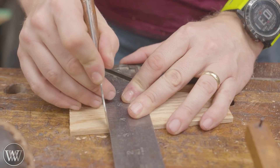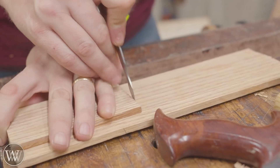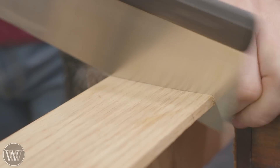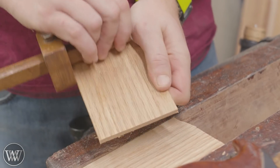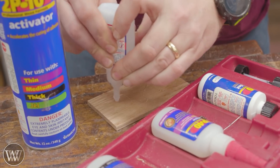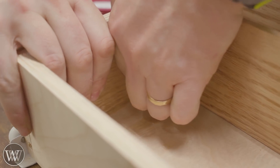Here we can use reality to mark how long this last divider needs to be. This goes from the last divider to the back of the drawer, keeping pressure on all that and holding them into place. We want to mark that off and transfer it to the other one so we can make sure both of these are exactly the same. It's better to do that than a tape measure because the tape measure always introduces a certain amount of irregularity - there's a thickness to the line on the tape measure so each board will be slightly different. For the dividers that go on the side I'm actually going to use a little bit of super glue, spray the side with activator, clamp it in place, and it's done.